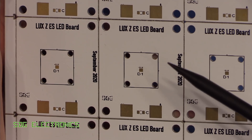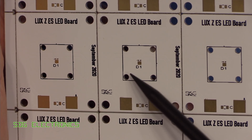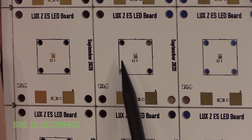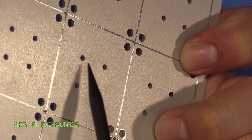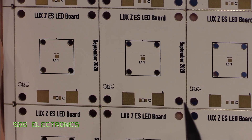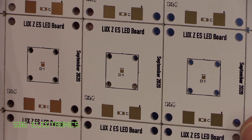So it's not that surprising that we got very similar results between these two types of substrate material. The reason why you might want to choose one over the other is mainly around the type of circuit you've got. Where you need the electrical isolation, this aluminium board is good because we've got that insulating layer. If you've got loads of different components all at different voltages and you just tie them into little copper sections, then you can easily conduct that through to your aluminium substrate and then off to your heatsink, which is a lot easier than dealing with copper vias at all different potentials.